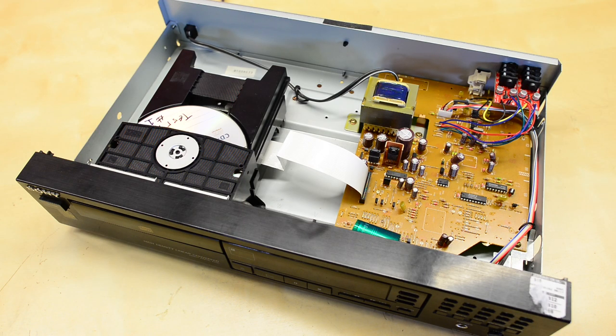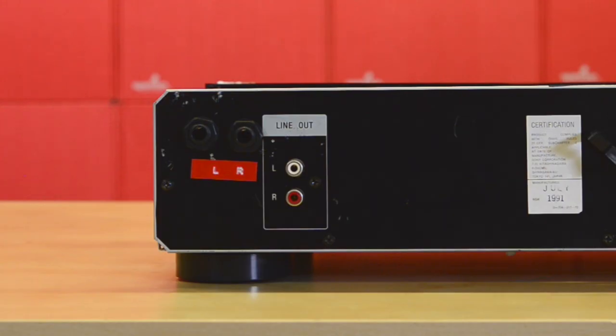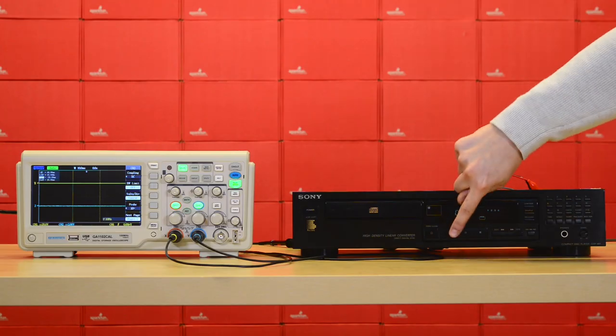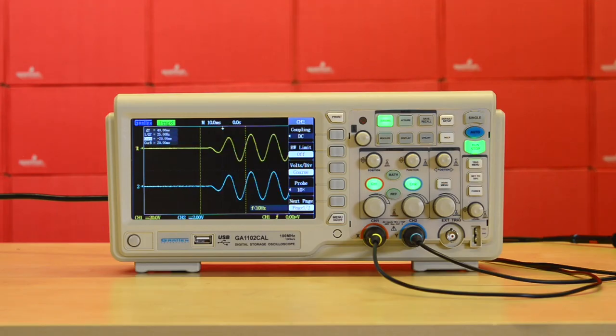In this example, we have augmented a Sony HiFi component CD player with balanced TRS output signals using a pair of the SparkFun That 1646 Outsmarts breakout boards. These have been mounted on the back panel next to the existing RCA jacks. Inside the player is a CD with test tones of sine waves. When we hook up the oscilloscope to either of our boards, we can see the sine wave being generated.